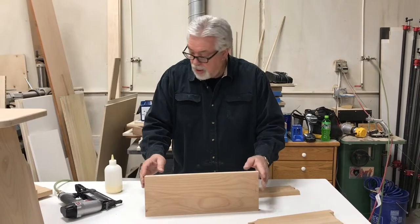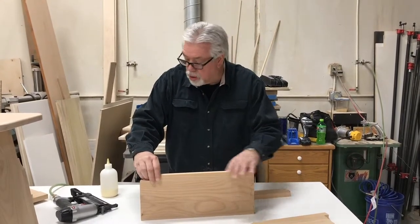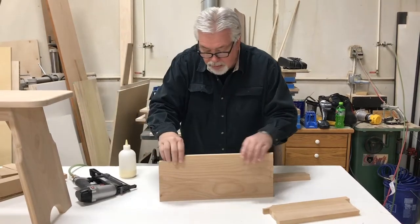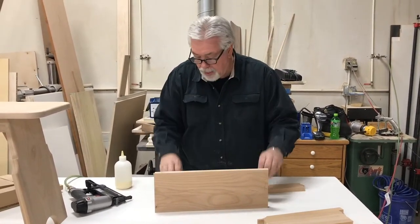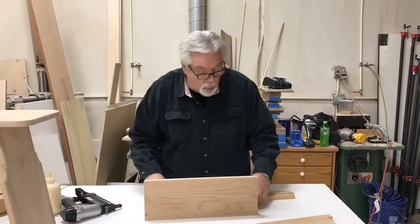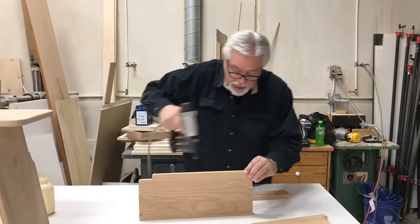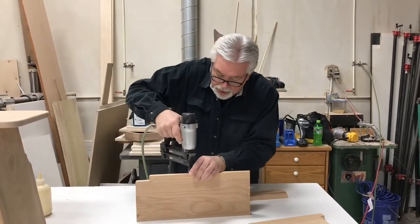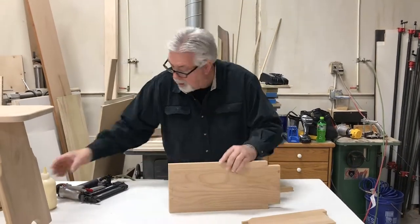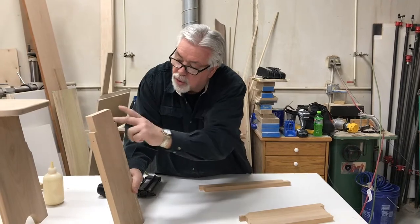The first step to make our legs is to add our first thickness of stock. As we add this on here you'll see that this makes a little slot here. This slot is for the space for our stretcher to go in, so let's put that on there — we're going to do that by just gluing and nailing. We won't worry about the nail holes because this particular project has a dark stain, and as we putty and sand, the dark stain is going to cover any of our nail putty. That's the first part of our leg, and you can see how the slots are ready for the stretchers.